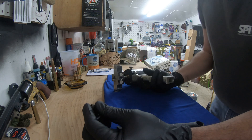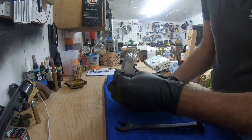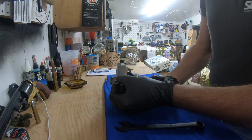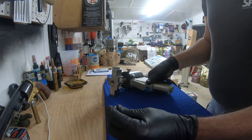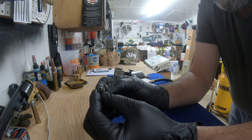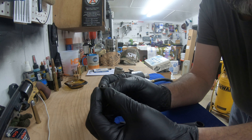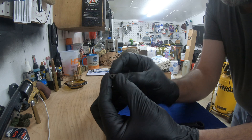One of the problems is that you can depress the trigger, install the chamber or module into the fluid housing backwards, get it onto the fluid housing, and get it sealed up. What happens when the user puts the chamber in backwards and pressurizes the unit is that when you pull the trigger, you'll only get one chemical out of the gun, because one of the impingement ports will be sealed off by installing it backwards.